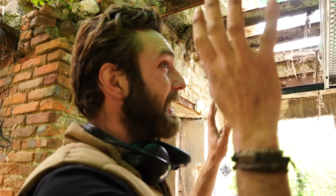I think I'll try tackle it side by side because this ironwork is doing something to kind of hold one wall to another, even though it has to come down. I think it makes sense to do it in stages, so kind of get this half done, bricked up, and then do the other half. Yeah, just getting all the materials up here is gonna be the issue.